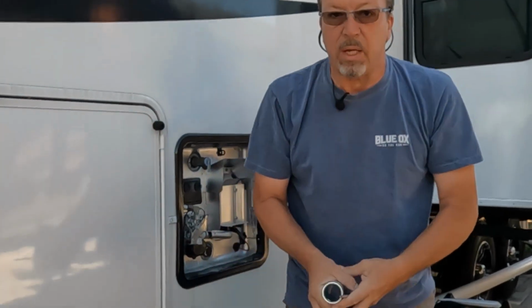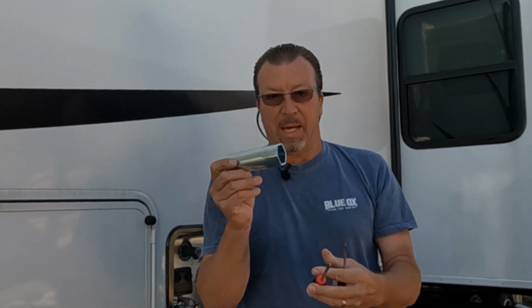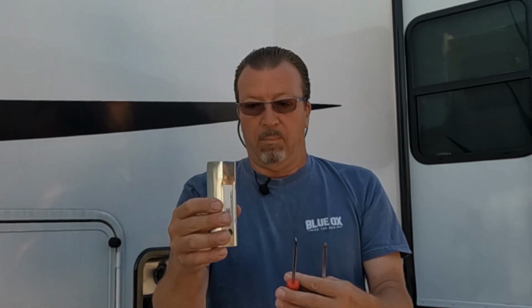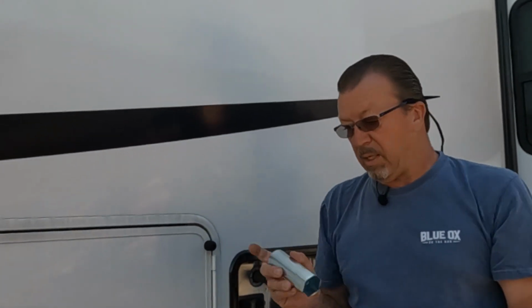This is just a bonus I'm giving you, because while we're in here, I'll show you, if ever you don't have any heat in your water heater, you can access that water heater yourself, take it apart, go to Home Depot or Lowe's and get the same water heater element, which is really easy to fix too. It's 1 1/2". I think I bought this at Home Depot. They're hooked up at the end of the aisles. There's 1 1/2", but you need this thin socket. A lot of times you'll see it in the box. You need a flat screwdriver and a Phillips. Don't screw the two wires. So let's get to it.